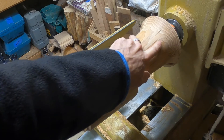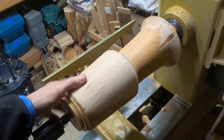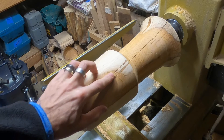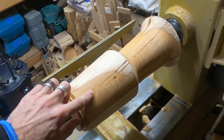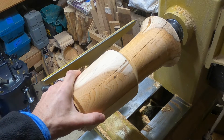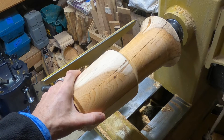The smallest ones I'll probably just throw some sawdust in with some CA glue. For this bigger one I'm not sure — I might try adding some pigment to that and maybe try the polycolor metallic blue that I have with CA glue. I've never tried that, so maybe I should experiment first to see if it will actually harden normally before I throw it into this piece. I'll give that a try and then bring you back when I'm working on these cracks.